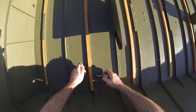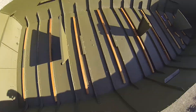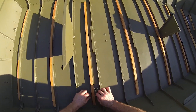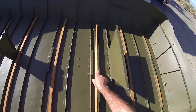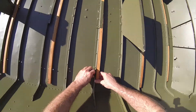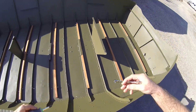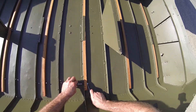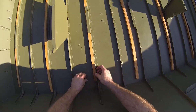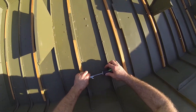The hardware I decided to use for all the pieces of the boat is stainless steel, that way it wouldn't rust out. So I had to have a stainless steel bolt and a stainless steel washer on either side, and a stainless steel nut for every single hole drilled through the frame. Then one at a time, make sure those were cranked into final alignment and final tightness so they wouldn't come loose, because once the floorboard was on it's going to be hardest to get to these again.